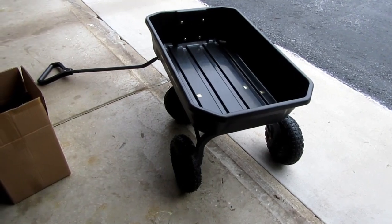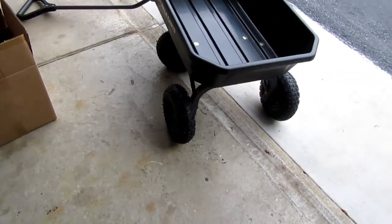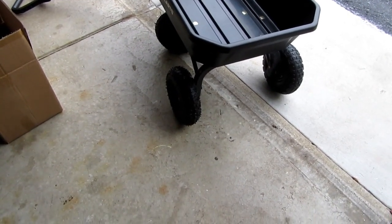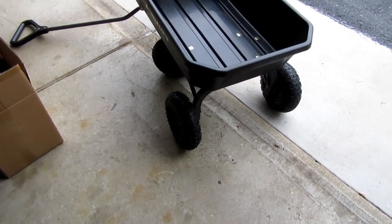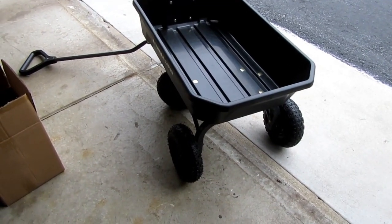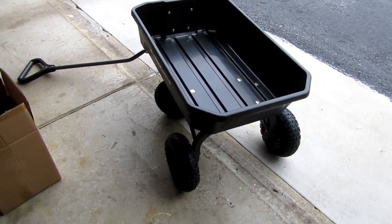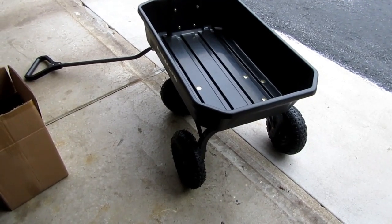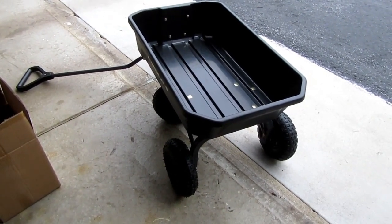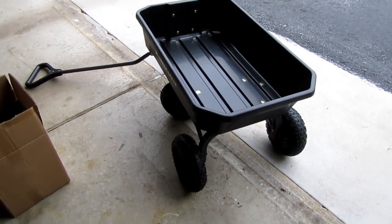Some carts come with no-flat tires. Those are just some sort of foam that's molded into the shape of a tire. They're convenient because you never have to put air in them and they work just fine. But the usual caution is that if you have a substantial weight on whatever thing those tires are on, and you leave it there for any extended period of time, the tires do not spring back from that flat spot — and then you have a permanent flat spot on the tire. In those situations, you wish you had pneumatic tires.